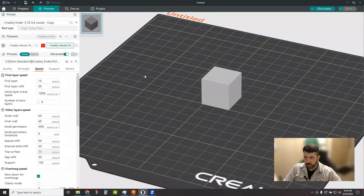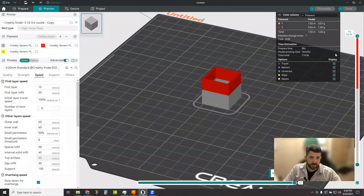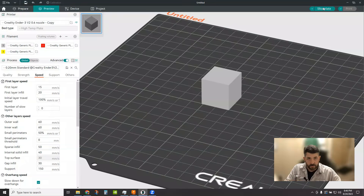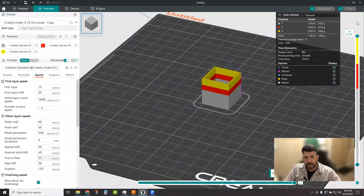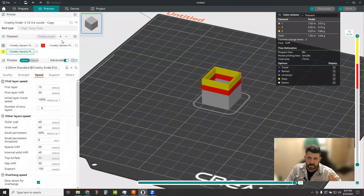You can add a third, fourth, or whatever — just hit the plus button. So if you want to add yellow that prints at 195°C, head back into the slice, scroll to your desired layer, change filament and add yellow, then reslice the plate. Now you've got a three-color cube. Walk through the same profile-saving process for each filament with its own temperature settings.